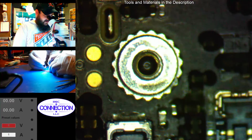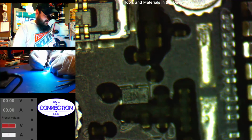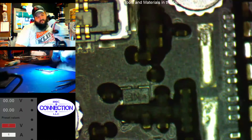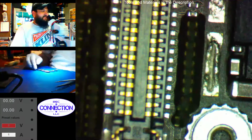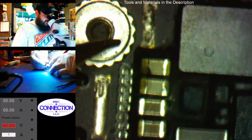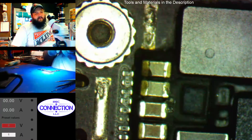Alright, we have output to our filter now. Let's check and see if we have a short on output from backlight. Now we're good. VCC main short. VCC main is not shorted, but it is at 370 ohms and falling. So that's not good. If we do it in diode mode, the VCC main line should be around 0.3 volts drop to ground, and it's currently 0.185. So we have a VCC main short.